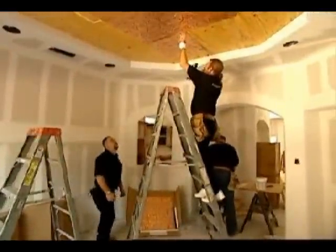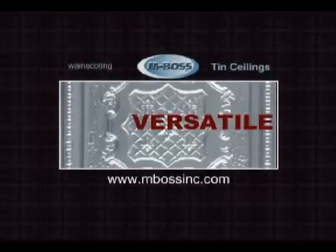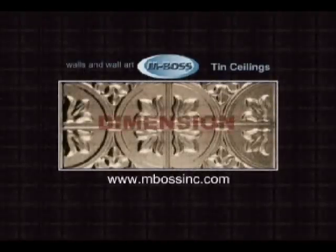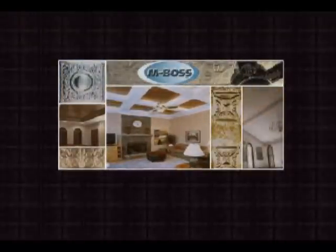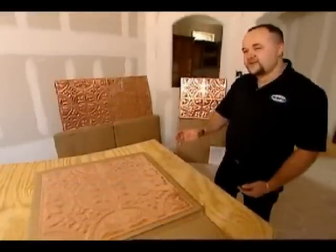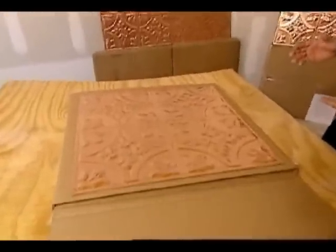Bill Perk of Emboss Inc. says the ceilings of yesteryear have returned to popularity due in part to today's innovative uses and improved manufacturing processes. In the old days they used a drop hammer press — drawn up by rope or chain — and the tool was smashed down upon a mating tool with the metal in between. The impact was enough to start to impress the metal, and they would do this several times until the impression was solid enough in the piece.